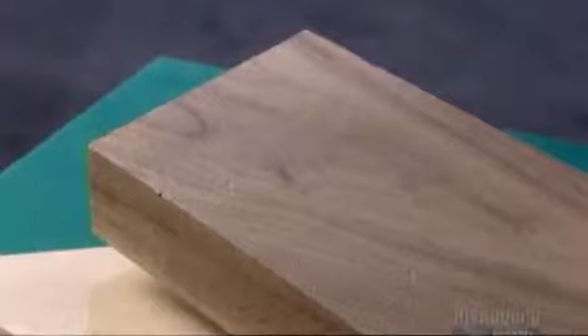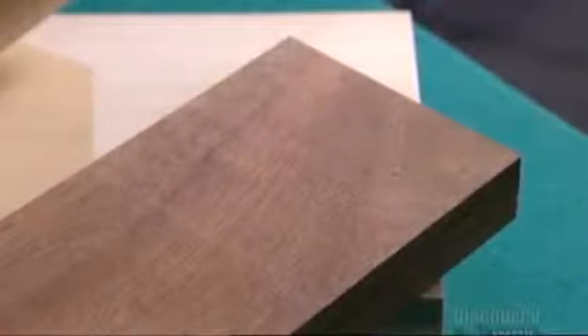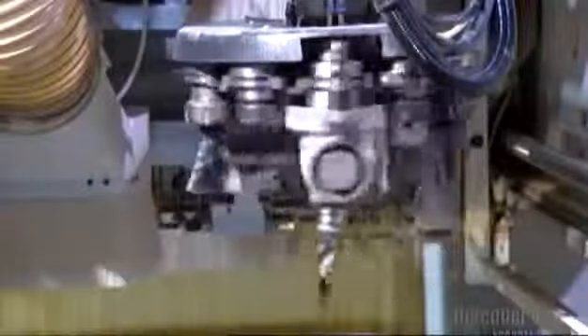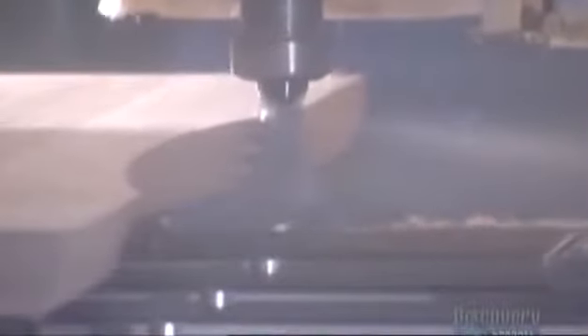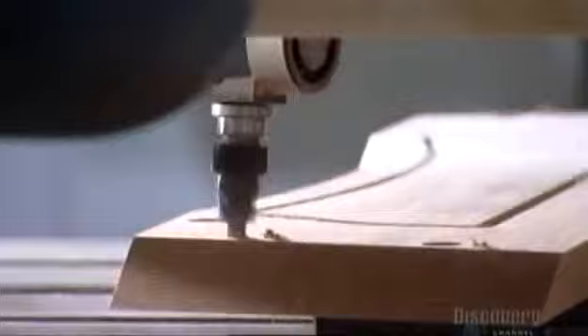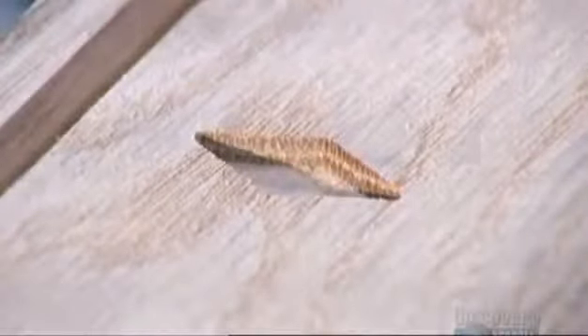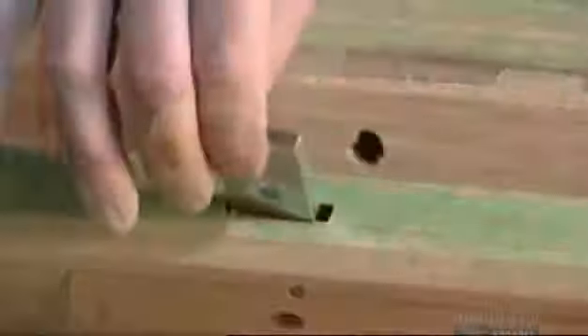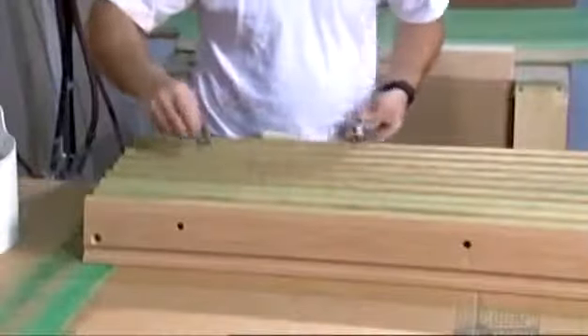The table comes in maple, walnut, mahogany, cherry, and the most popular — oak. A computer-guided machine shapes part of the table's frame, with rotating heads performing several different tasks: a profiling head carves the frame angle, a routering head creates decorative grooves, and a drilling head makes holes for bolts. Six wood components called rails will surround the playing surface, featuring diamond-shaped carvings as visual markers. After spraying the rails with glue, a worker inserts 18 metal nuts, then attaches rubber strips along the sticky rails to cushion the balls when they hit the sides.